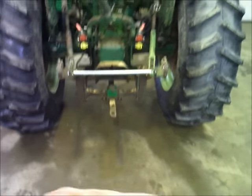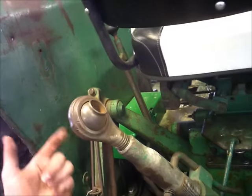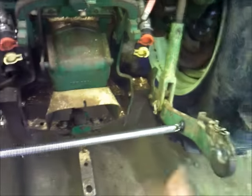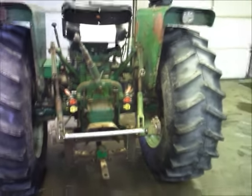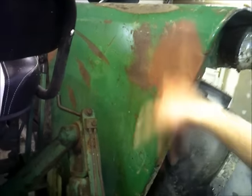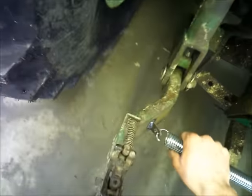The reason it's all pulled up funny is I got it set up for running category one implements right now — normally it'd be right about there. To switch from cat two to cat one, all you do is there are spacer blocks that go between the arm and the wear plate, then you change out the center link to a cat one ball. That takes care of that project. I'm not gonna bother painting the tabs — for little stuff like this I like to just let it stay bare metal, let it rust a little bit, and then it blends in with the tractor and you can't hardly tell it doesn't belong there.